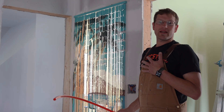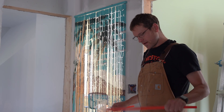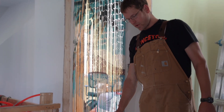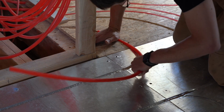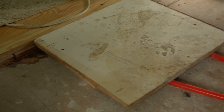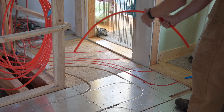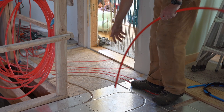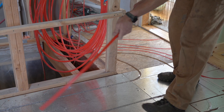One of the most important parts to me was to put in radiant heating and cooling — that is, putting the heating and cooling into the floor of the building. For the new construction upstairs we put in this subfloor, which is plywood with grooves in it that lets me run piping around to distribute heating and cooling throughout the floor. You can see each room has its own separate zone — the bedroom pipes go in and come out here, go in and come out there.